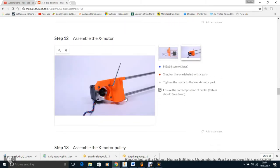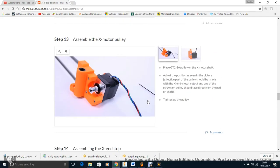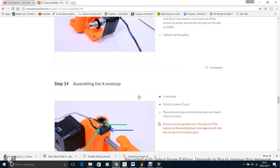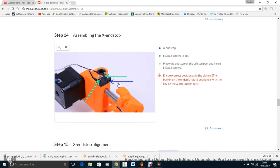Add the motor in, but again — like with the Y-axis — you'll need to loosen it again. Take off the two top screws and let the motor fall down slightly so you can loosen it and get the belt on. Don't worry about tightening them just yet. Also, take note of the position of the wires as you go — it's a nightmare if you have to take things off and put them back on. Make sure the pulley on the motor is on correctly. The end stop is easy — it lines up with the holes.